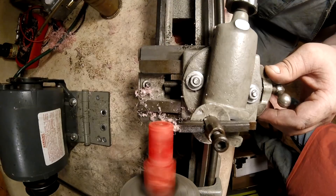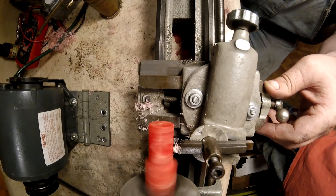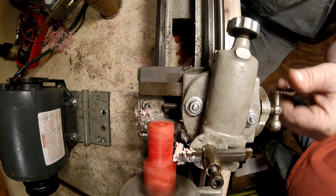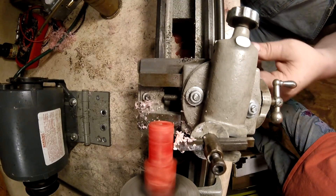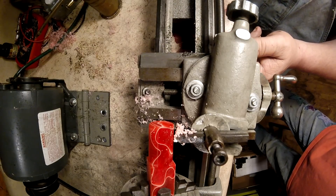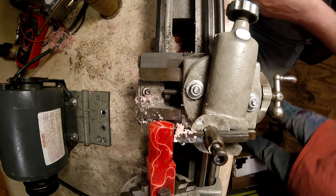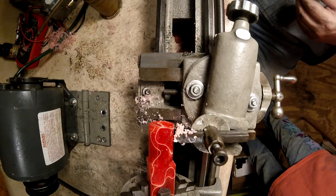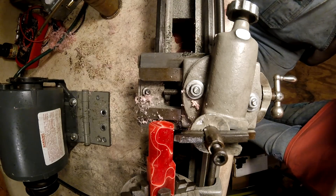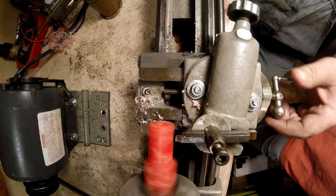Go out here — bump. When it does that, come off. What you can do is turn the lathe off — this is a little bit of an operation. You can put the lathe in reverse — the lead screw in reverse — and make sure you're backed off, and then you can turn the lathe off and let it run itself back.